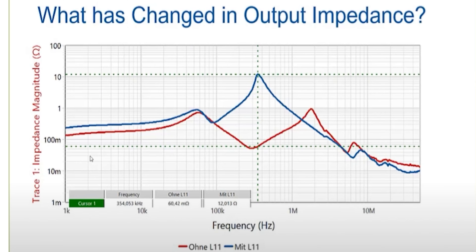What they did is put a ferrite bead on the output of a power supply, then shorted around the ferrite bead, and compared the output impedance in the two situations. The power supply has a lower output impedance in mid-range frequencies from 100 kHz to 1 MHz when they shorted around the ferrite — essentially removing it from the circuit. In contrast, the blue curve shows the output impedance peaking up to 10 ohms — exactly what we don't want from a power supply that needs to supply power to digital circuits.